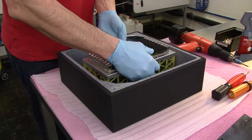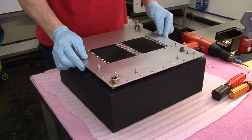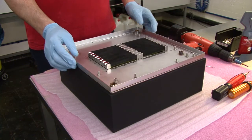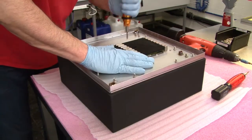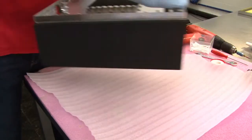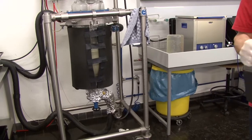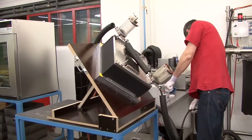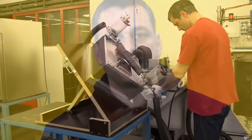Another innovation of the ISAR is the dielectric medium. The sensor array is surrounded in a medium that represents the parameters of the human body or head over a very large frequency range. This means that multi-band wireless devices can be evaluated quickly on the same ISAR device. The medium is completely locked inside the housing so that it never needs to be replaced or adjusted.